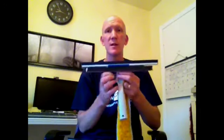He was having some issues on a few windows where during the squeegee part this bunches up, causes a little bit of problem closing out, so he decided it might be better for him to put the scrubber on the backside. So what he ended up doing was he took this aluminum plate that has Velcro on it, he screwed out the rivet so he could take that bar off, basically put the bar on the back side. That way he could have the flipper pad here, do scrubbing on this side and then turn it around and do the squeegeeing.